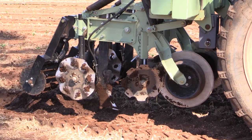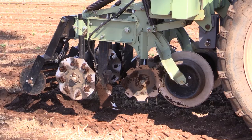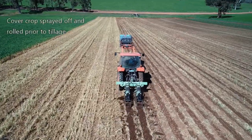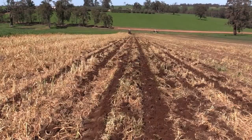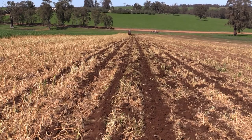We came across two ideas: no-till, which is still being developed, and strip-till, which people have had a fair bit of success with. It pretty much cuts a line in the ground, followed by a deep ripper shank, then two wavy coulters and a basket crumbler roller, making a nice little strip just the width for the transplanter. It leaves all the inter-row on either side of that strip untouched, so you still retain that soil structure and don't affect the soil life too much.